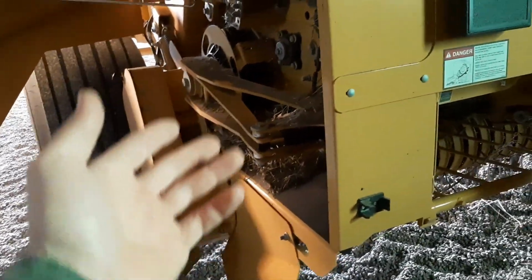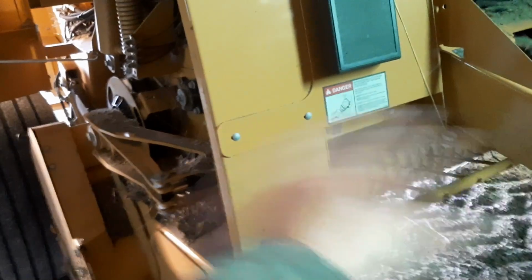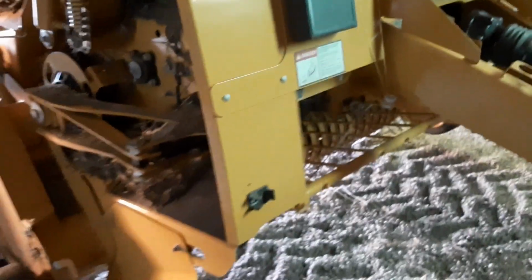It's also nice for diagnosing stuff, because you can manually kick it out. Like if you're hearing a funny noise in the baler, you can kick it out manually to pinpoint it more, having that whole picker system off. Or for oiling your picker chains, you can disengage the picker once you get your chains oiled. Stuff like that, just quality of life.